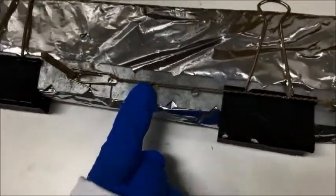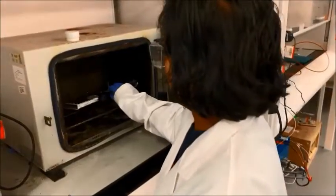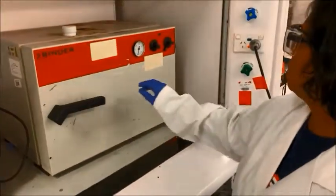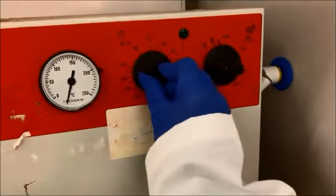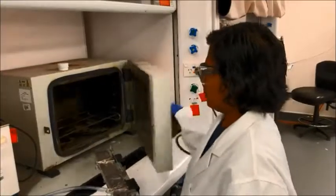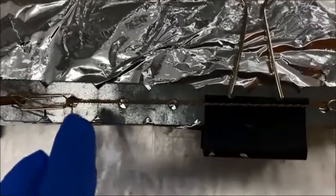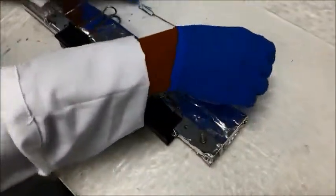The reason for this stretching is to open up gaps between the turns in the coil. This allows room for contraction when we operate the sample as an artificial muscle. The second stage of heat treatment again involves heating at 180 degrees for one hour, cooling to room temperature, and now the coiled and stretched structure is fixed. We normally leave the sample for at least 24 hours at room temperature before we do any testing.